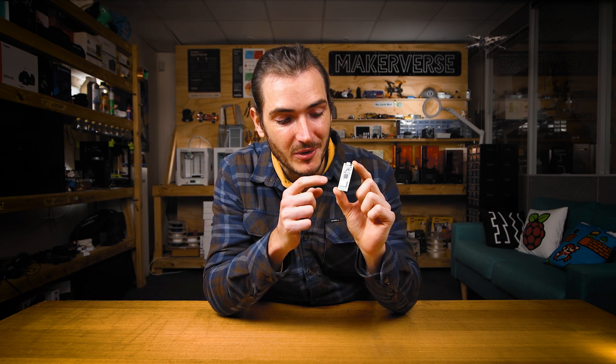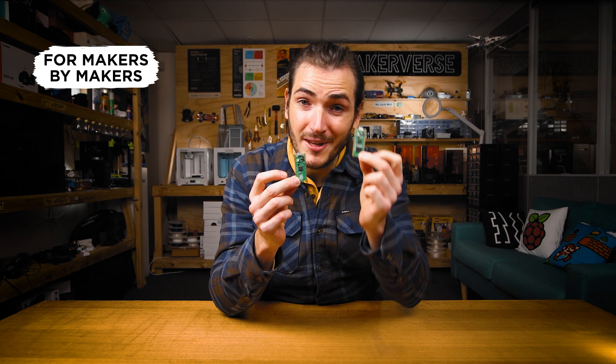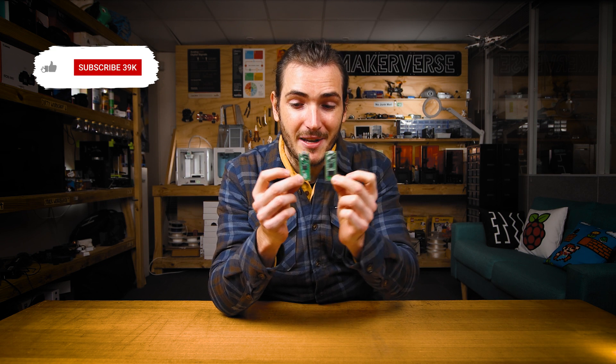The Raspberry Pi Pico W is a powerful and affordable Wi-Fi development board. It features the same RP2040 that was on the original Raspberry Pi Pico, but it also has a Wi-Fi and Bluetooth radio. It's based on the original Raspberry Pi Pico, meaning that all the external 40 pins are pin-for-pin compatible, so you should be able to transfer your projects from one to the other without changing any code. We're going to take a tour of the board and talk about its features. Let's get started.